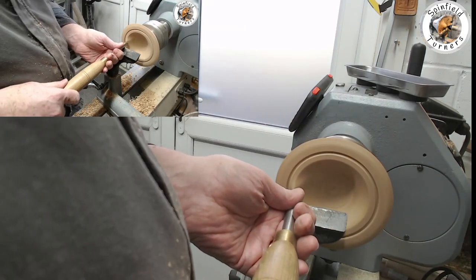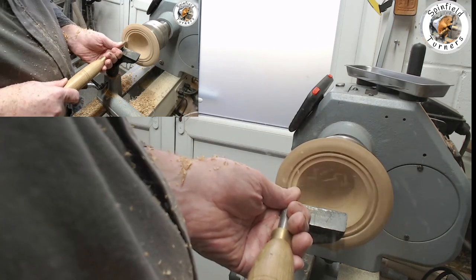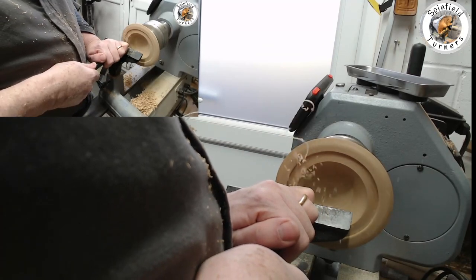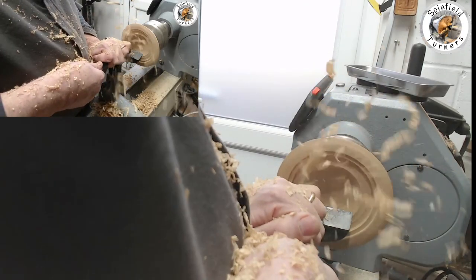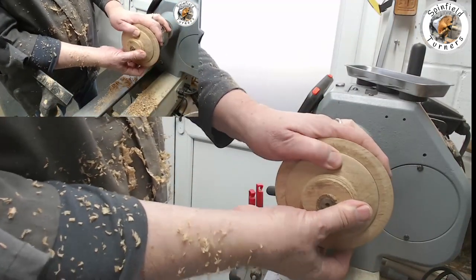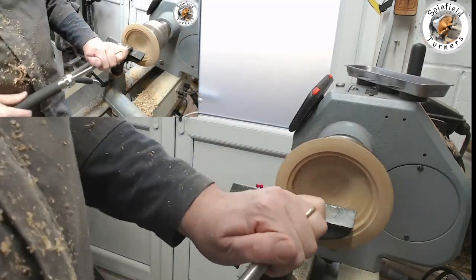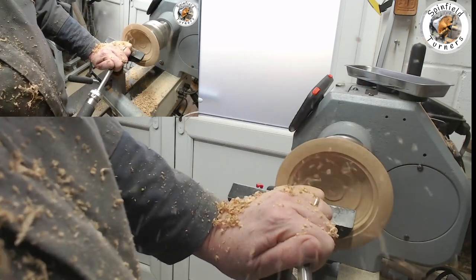Before I forget, I've got to make sure the lid sits in properly — removing some waste and creating a little step into which the lid will sit, hopefully looking seamless. I don't want all of that width as the step so I'm just going to thin that down a bit and check the fit. The lid fits quite well but probably needs a quarter of a millimeter taking out. I'm not going to do that now; I'll hollow out the rest and let the wood relax and the stresses dissipate, because something's likely to go oval, and I don't want a perfect fit now that becomes a sloppy fit later.